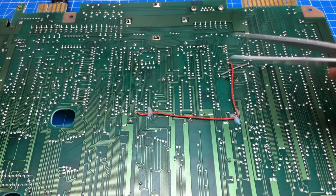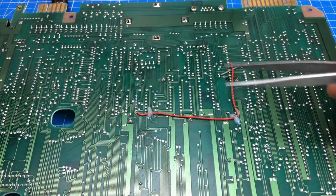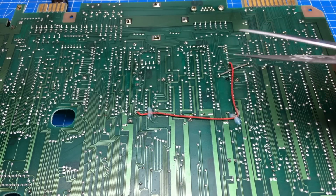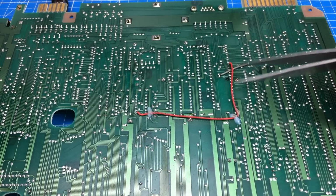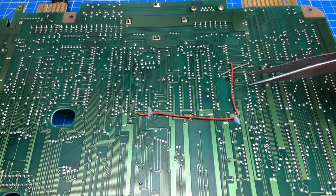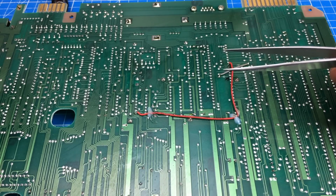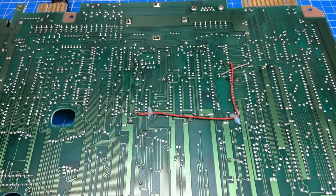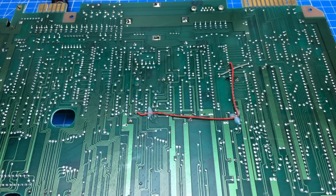So everything I did was okay. The capacitor didn't do anything. It wasn't the capacitor causing the fault. It was just me putting this on the bench and this poking through there and causing a short. So that's the thing. I'm going to put some tape there, I guess, or maybe replace the wire altogether.